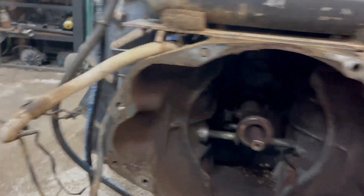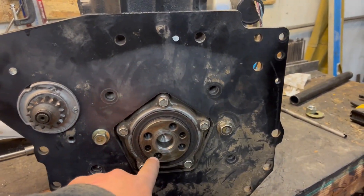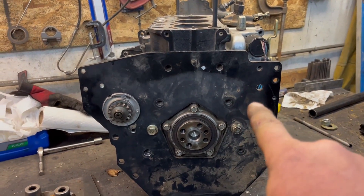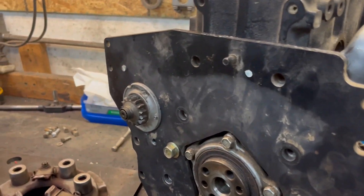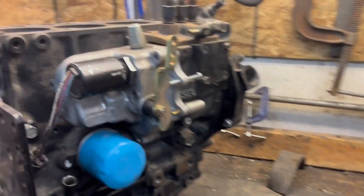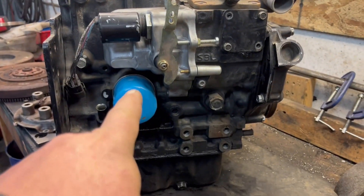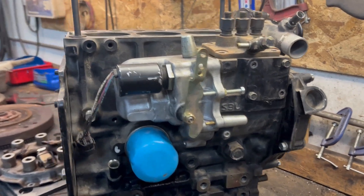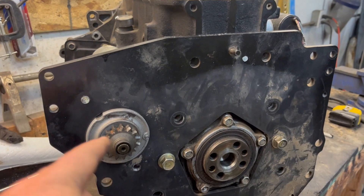Imagine sitting on the machine facing me — on your right is where the starter would be. Here's the replacement engine. When we look at it from the driver's reference point, the starter is over here — on the left. That's a problem. The starter's on the wrong side. Now this adapter plate can simply be flipped so the starter is on the other side, but here's the problem with that: this engine has everything else on that other side — the injection pump, the governor housing, the shutoff, the oil filter, the dipstick, everything. There's no room for a starter over there, so the starter has to stay on the left.